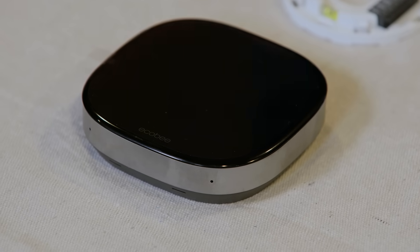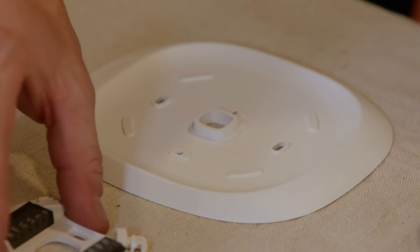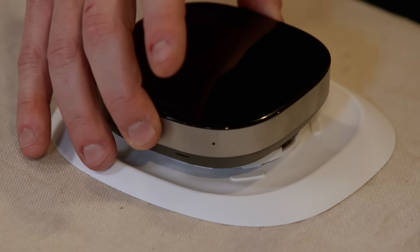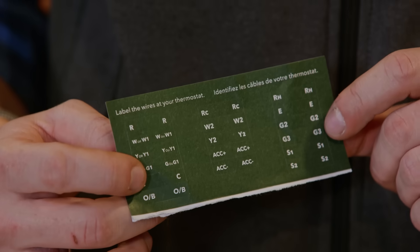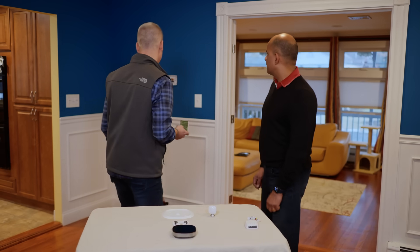So here's the thermostat I've chosen for you. For one, it is compatible with dual transformer systems, so this one will work with what you have. Here you have the thermostat, the back plate, and the trim plate. This is going to mount into the trim plate, and that is what you're going to see on the wall. They also send us some labels so we can label the wires, and they also give us a remote sensor — great for when you don't want to sense at the thermostat and you can sense temperature somewhere else. So if you can help me get the labels on the wire, we're good? Absolutely.